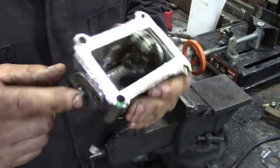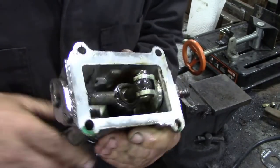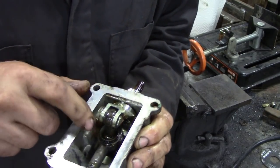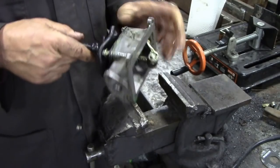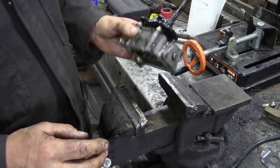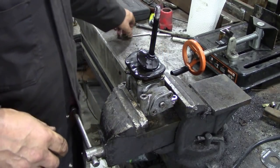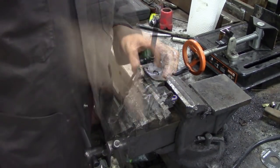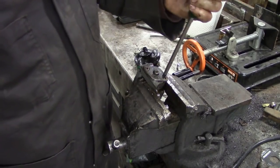That's usually seized up in here or a bit tight. So what I think we'll do with this one is strip it down completely. I did one before that had a detent in here, but this is the later type and as you can see there's no detent spring in here. Might as well get value for money and do it twice. Let's put this in the vise — I don't know how we're going to do it because it's offset. What I'm going to do is take the cover off. I won't film that because it's kind of easy — I'm just going to use a little ratchet spanner and pull this cover off.